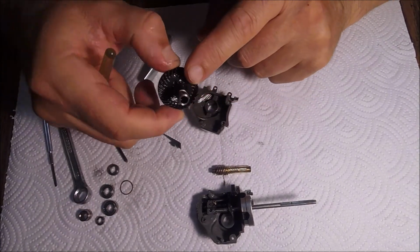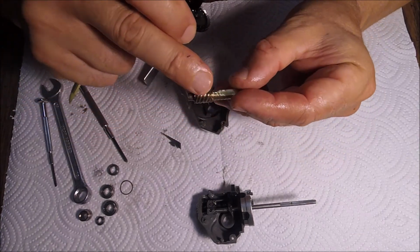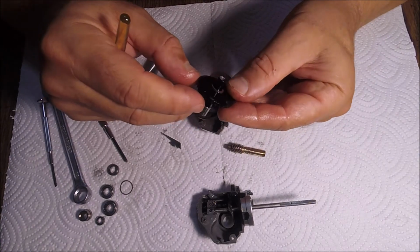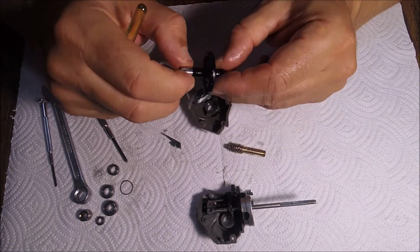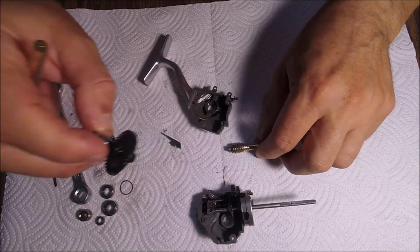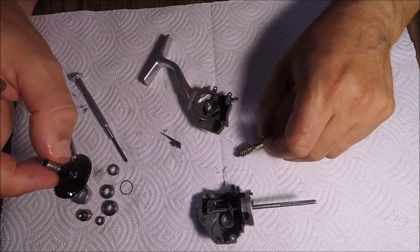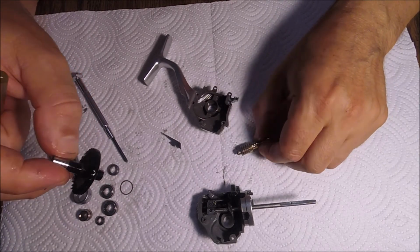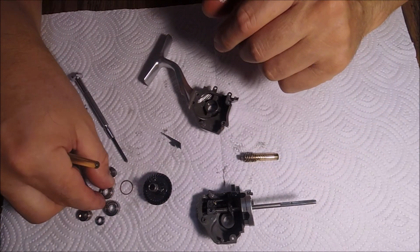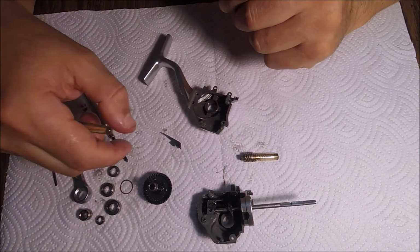You have to make sure that all those gears look fine, especially the brass ones. If there's no damage, you don't have to buy new ones. But if there's any damage, I would recommend replacing them. Same with the ball bearings: if they're loud, or you can hear something like sand inside, I would just replace them. I wouldn't mess with it. They're not expensive. You can probably get a bearing for $5–6, and you don't have to replace all of them.